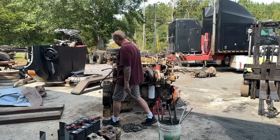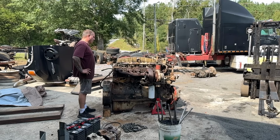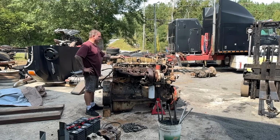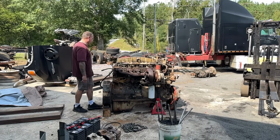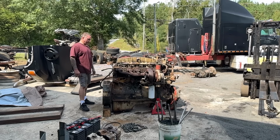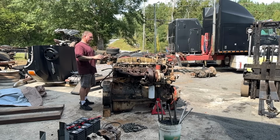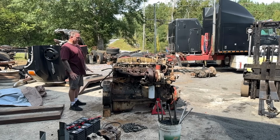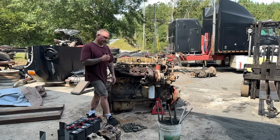I am happy with the oil pressure. The engine seems to start nice, even with the injector push tubes being all bent to hell. We're probably going to grab 6 new injectors as well. They're pretty cheap, so we'll see about getting a set ordered. We already got the gaskets we need. My wrench should be here for the air compressor tomorrow. So today I'd like to get it blocked up, get the cover off, get the camshaft timing looked at, and see what's what, and then get it covered up. So let's get after it.